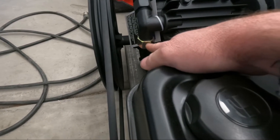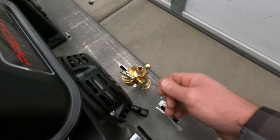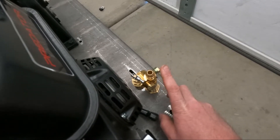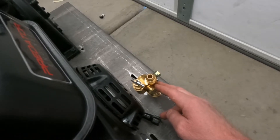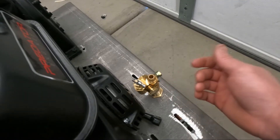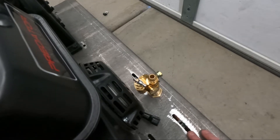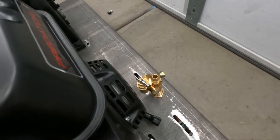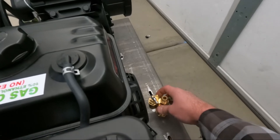I need to run to the hose shop and get a stainless steel line that goes from this JIC fitting and runs down to this valve. What's different about this compared to an electric compressor: when you stop building air the engine is still running. The check valve doesn't let your air pressure from the tanks come back through - instead it switches and just vents all the air coming out of the pump to atmosphere so the engine can stay running. Then when you use enough air, you'll hear it switch back and it'll kick the throttle up on the engine and start building air again.